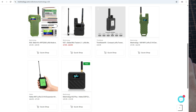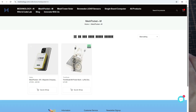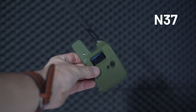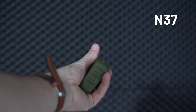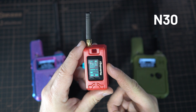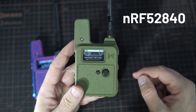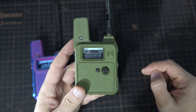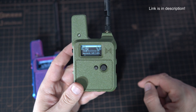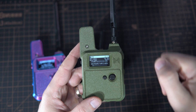The company MeshNology sells these MeshNode kits and on their website you can find many different versions. This is one of the newer generations. This kit is MeshNology N37 while this one is N30. The N30 is based on ESP32 and the N37 uses NRF52840, which provides much lower power consumption compared to ESP32. This one also has a much larger battery, longer antenna, and built-in GNSS or GPS.